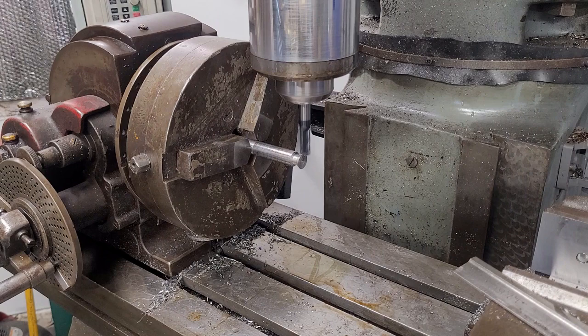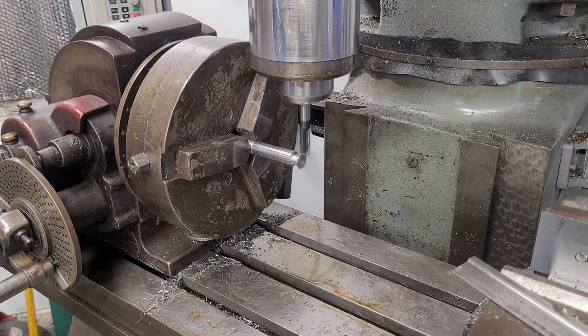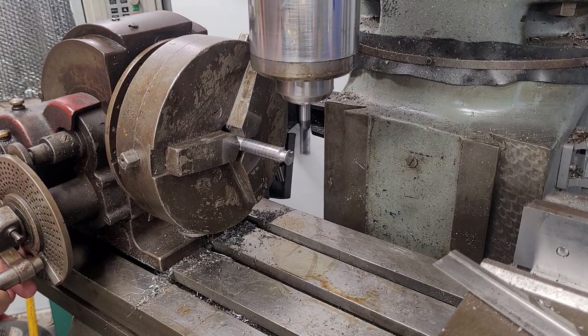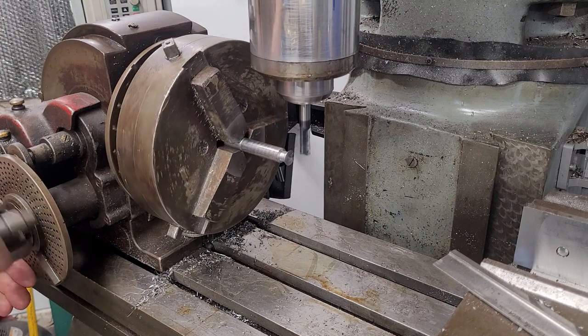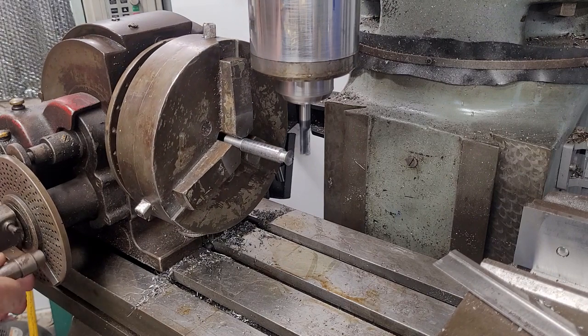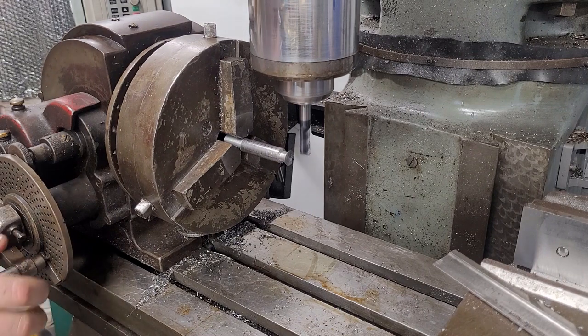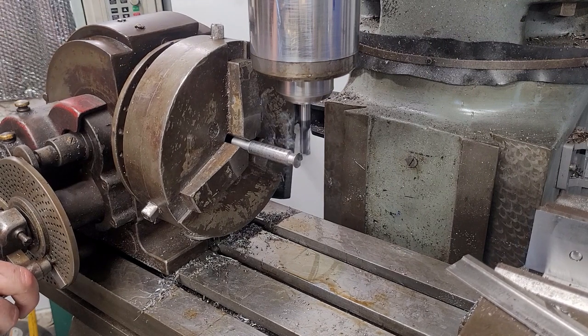The web of the tool is the center section. I did this in a couple of passes to get on center, marked the digital readout on the mill, set where to stop, and locked the gib so I could not travel on the Y-axis — I wanted to be the same equidistant across all of the flutes. I did all my cutting in the X-axis, as you can see here.